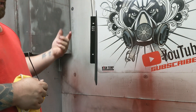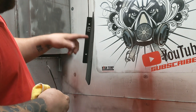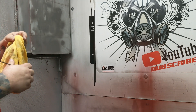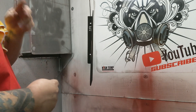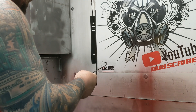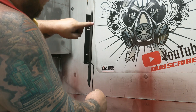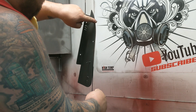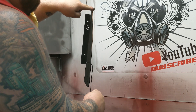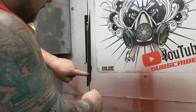Because this is hanging, obviously if you touch it, it's going to sway a bunch. If I run my finger right here, it moves away, so I don't get a nice clean wipe on it. The way you get around that is by taking another hook. I put the rag on my shoulder, and you take another hook and put it in one of the bolt holes or any hole, depending on what you're doing. In this case it's a diffuser, and this one has a weird notch up here where there was some damage. You'll probably have to get that with a Q-tip. All you're doing with the hook on the bottom is holding some tension on this.